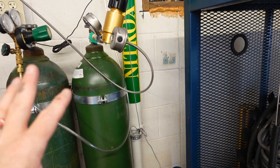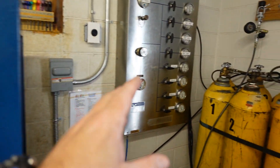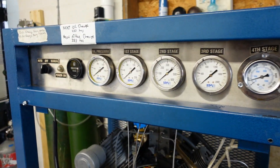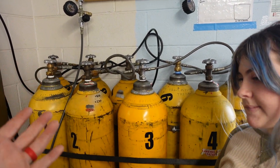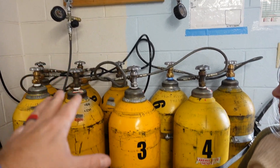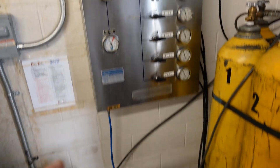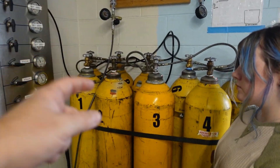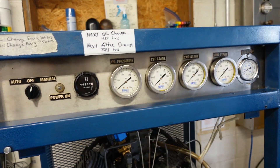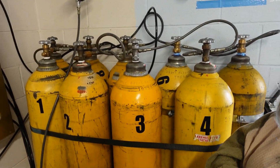We will come back to the nitrox stick shortly because I'll show you how the O2 system works. Basically we're pumping air in — it's dried, clean, and compressed — goes through the system and then over to our cascade bottles. Now we can fill directly from the compressor straight to the bottles, or we can use the compressor to fill the cascade. Think of the cascade as a bank system — we have nine banks here with excess air stored up. That air goes back through the fill station and we've got all these fill ports that we can connect cylinders to. And the cool thing is we don't waste air by cascading — it's a much more efficient and better way of doing it.